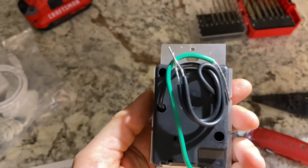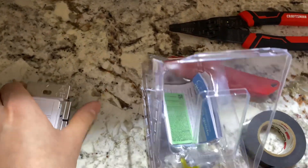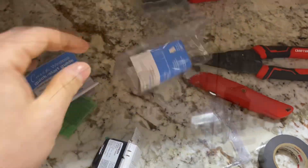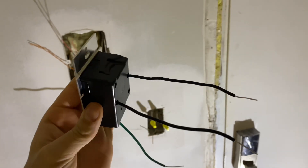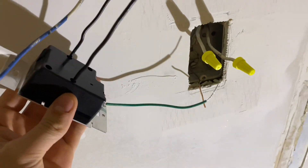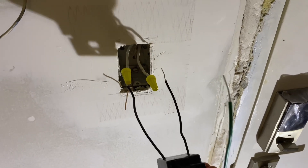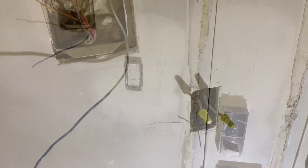So I just opened the box. It has the two black wires and the ground. It also comes with some hardware, wire nuts, and some information. Exactly as I show you is how it goes — you have two black wires and you have one green. The green goes to the copper, which is the ground, and the other two in any order go to the two other lines. It's as easy as it gets.